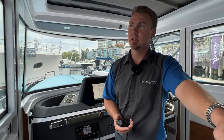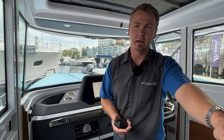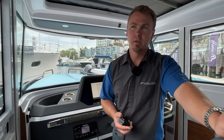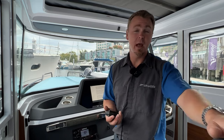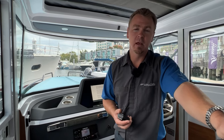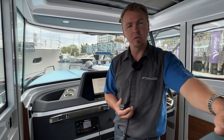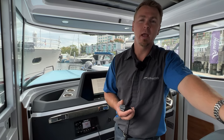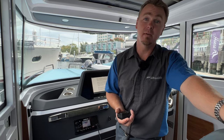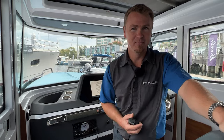So if it's 2x1, then it is not very loud and not very clear. Your strength of output, your antenna, the noise around you, and how far away you are from things can all affect that. Ultimately, you're looking for a 5x5, but with a 3x4, I think she said it was, we would essentially be very capable of maintaining a conversation on the airwaves with a result like that. So without further ado, let's get back to the main video.